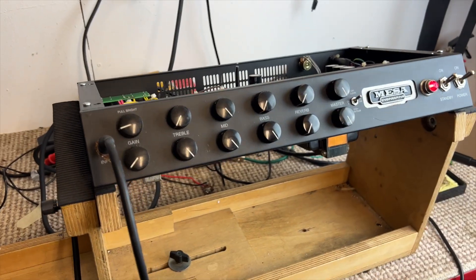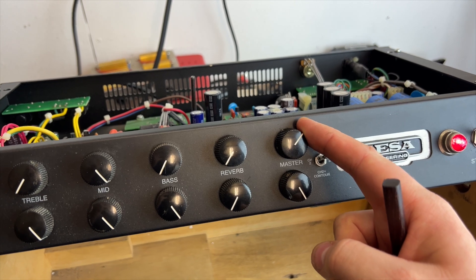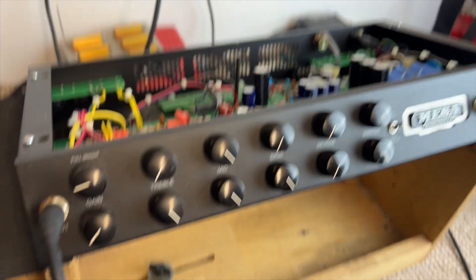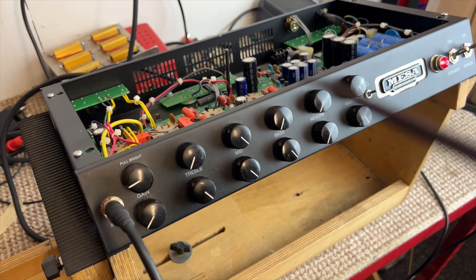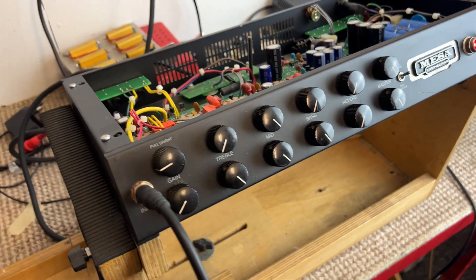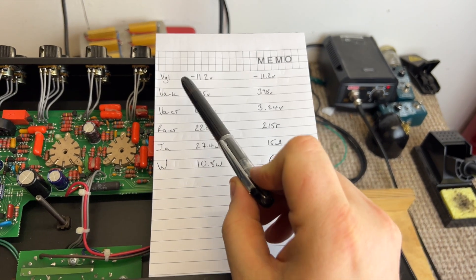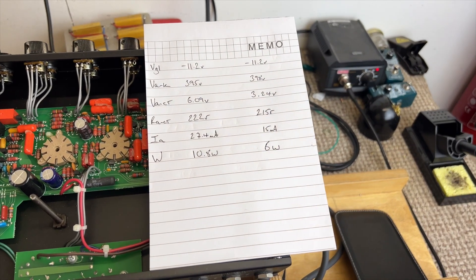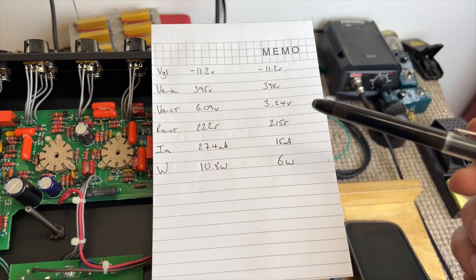The only thing I did notice was when I was fiddling with this, it came to a hard spot — like there's something stuck in there — and then as I wiggled it, it worked its way loose. I don't know much about these amplifiers. I'm going to pull the schematic, see what I can learn, see if we can work out what's going on. So I've taken some bias measurements. First thing I do is check the negative bias voltage on the control grid of the output valve — both at 11.2 volts. The schematic I found online calls for negative 11 volts at that part in the circuit, so we'll call that good.